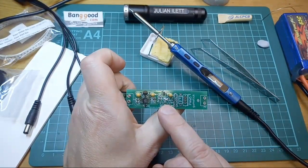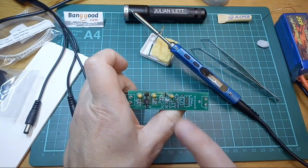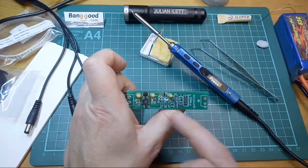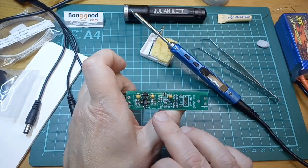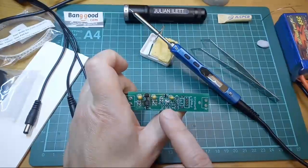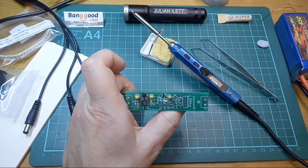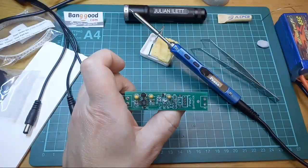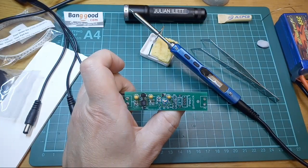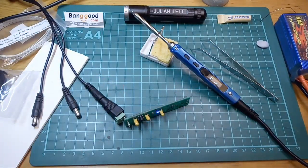Okay, what is it? 1, 2. About 7 or 8. Think about those fast flashes. You can't really count them, but it doesn't matter too much because all this is doing is giving you a rough impression of what the voltage is. So it's about 12.7. And if I look at the thing in the cigarette lighter distribution box, it's saying the same, 12.7. So we've got about 12.7 volts. The question is, have I got 20 volts on the output of the charge pump? That's going to be more difficult to fathom out, and I need a DVM. Let's look at some comments.